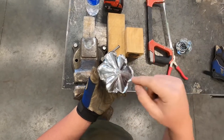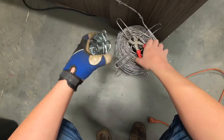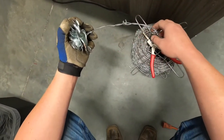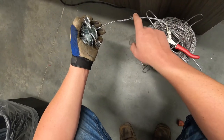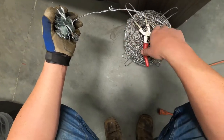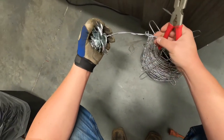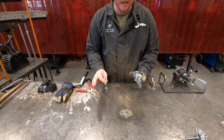Cut as close to that nut as you can — that's where we're going to tack our stem on, and that's the next step. We've got our barbed wire; by eye, decide how long the stem needs to be for your rose. I'm going to get it with two barbs in there and cut it around there. Regular welder's pliers should cut this. Now we're ready to weld them together.